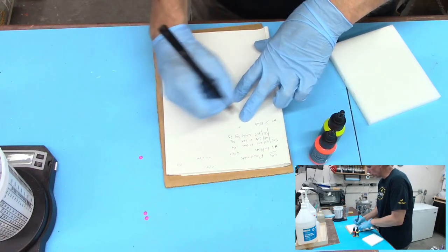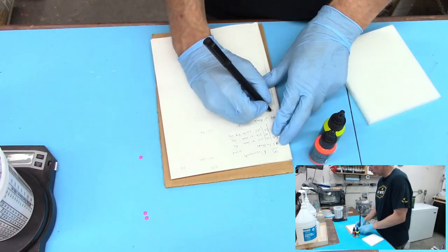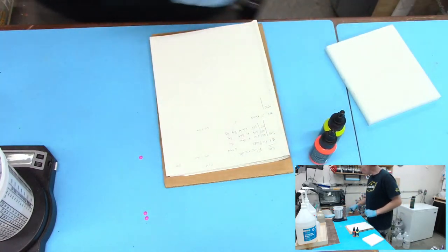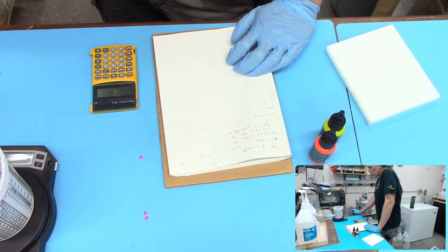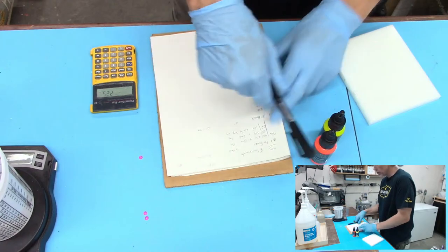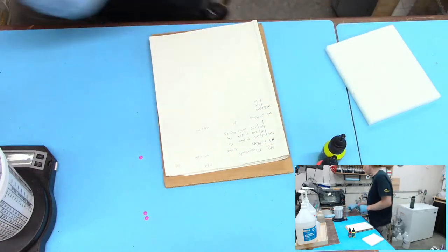So for this one, we're using the 2-inch, I call that my 2-inch mold, and we're going to do slow set clear again. Now, that 2-inch by 6.5, I want to say holds about 450 grams. I'll just go with that. And then we're going to do 2 colors plus just a very tiny bit of white. So I think what we can do is like 210 grams. I don't know what percentage that is, but we're going to go about 210 grams of each of our colors, and then about 30 grams of the white. That's how I'll break that up.